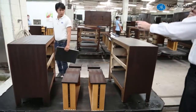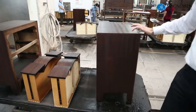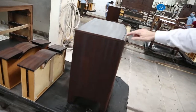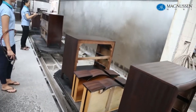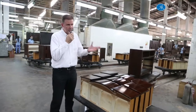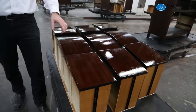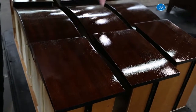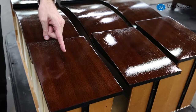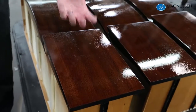You'll notice here we had made it very dark before. The technician is now using a tool to take some of that finish away, giving it the high and dark-and-light spots on it. This is all part of the requirement so that when we get to the next step and they put a sealer on it to lock it in, you'll see how it brings the whole group to life and you'll see the clarity and depth to this. We put the glaze on, which makes it dark, then we use the highlighting to remove some of that. You can see how it was before when it was dark, to what it is now — through the glaze process, the highlighting process, and now with a sealer on it, you can see how it's bringing the life to this finish. It feels like it's got a two-meter deep finish — there's a lot of clarity and clearness to this.